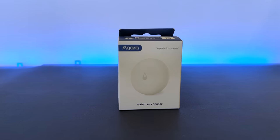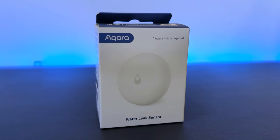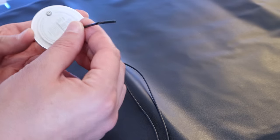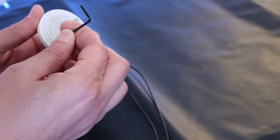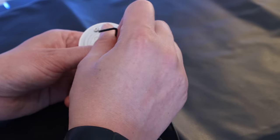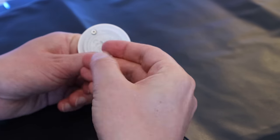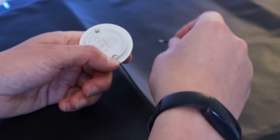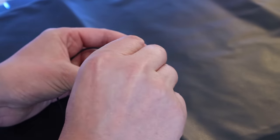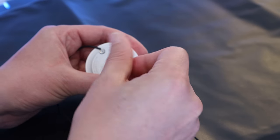The easiest and fastest way to hook this pressure mat up to your smart home platform is to use an Aqara leak detect sensor. This sensor uses Zigbee and is compatible with the Aqara Hub, Apple HomeKit, and of course Home Assistant using ZHA or Zigbee2MQTT. It has convenient terminals on the back which you can unscrew with an Allen key and then attach the two switching wires to these terminals, one on either side. It doesn't really matter which wire goes on which side — all we're doing is completing the circuit across the two terminals.